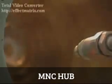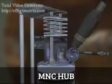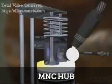In pintle type nozzles, a pin or pintle protrudes through a spray hole. The shape of the pintle determines the shape of the spray and the atomization of the spray pattern. Pintle nozzles open at lower pressures than hole type nozzles. They are used in indirect injection engines where the fuel has a comparatively short distance to travel and the air is not as compressed as in the main chamber.